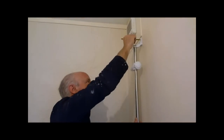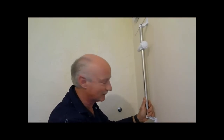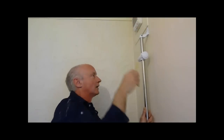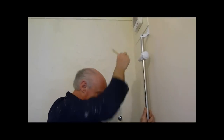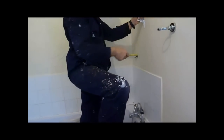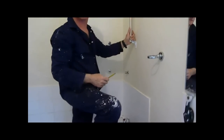We're putting this up as it is now — I know we should have tiles on the wall really, but we want to get this shower up and running so we're going to tile later. We're going to screw this up for now, make sure that's level. Always put it up and try to get the shower rail centred with the centre of the bath tap down below, so you know it's roughly in line with the middle of the bath.